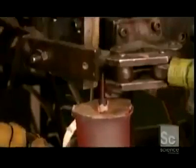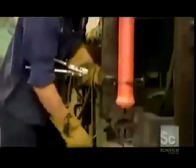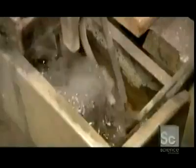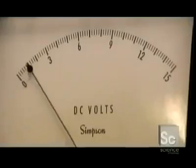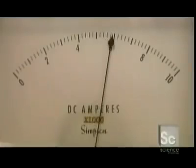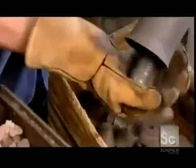The rod slides down the center of the copper pipe and is clamped into place. Water keeps the pipe from melting as a low voltage, high current charge is delivered to the rings inside. Workers break open the seal, and the process has left the rings mildly magnetized.